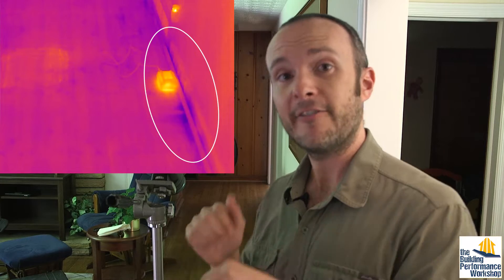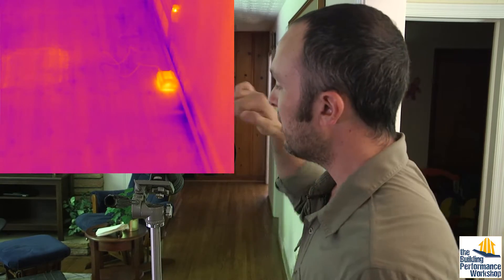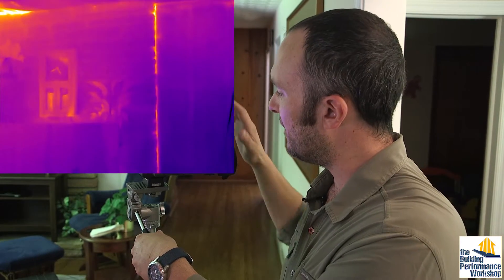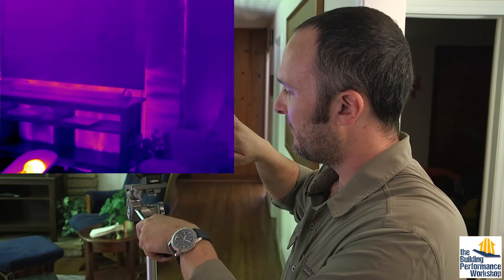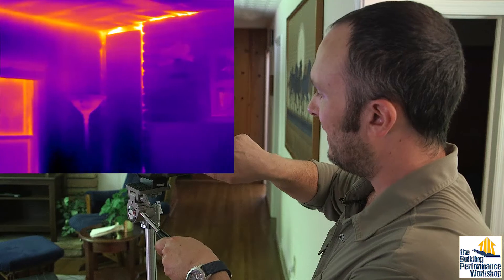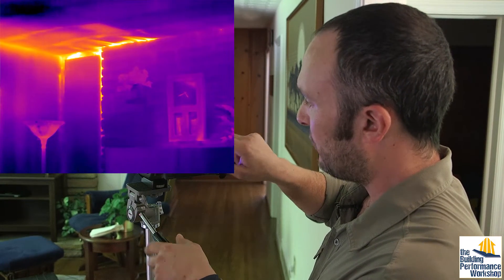We can look down and see fingers of air coming up from the crawl space — cooler air because we've been air conditioning the house and that conditioned air sinks into the crawl space. Now we're backwashing it back up into the house. Fingers are what we're looking for in air leakage diagnostics with an infrared camera. Scanning over the fireplace, we can see a big bright line and a bunch of fingers coming out around the gas fireplace insert — all kinds of seams and joints that are not airtight. We also see a built-in cabinet with significant air leakage.